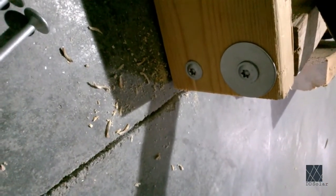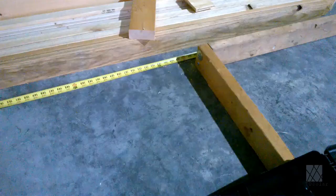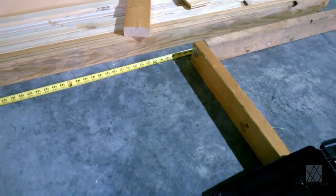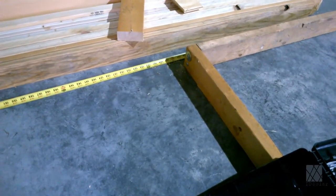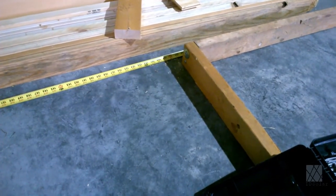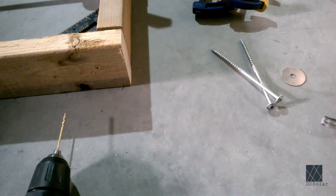As you can see, I'm using 2 of these 6-inch structural screws. One of them has a 1.5 inch stainless fender washer. Over there you can see the other corner that I've completed. Now these corners will receive additional bracing material and diagonals, but this is just to tack the frame together. Okay, I'm going to go ahead and do this corner on camera.